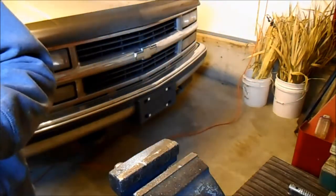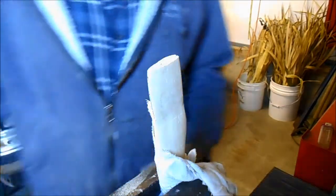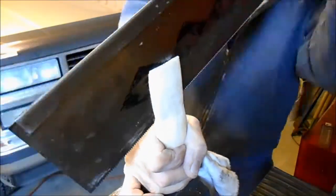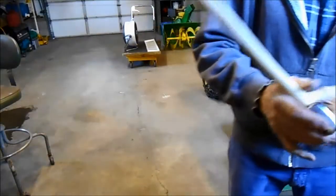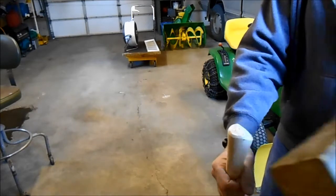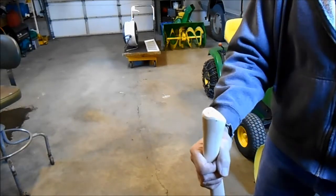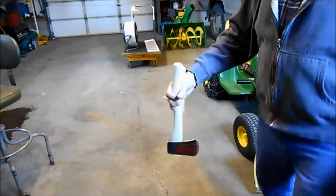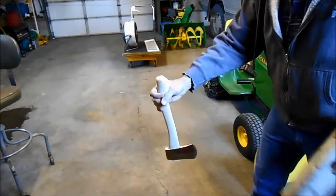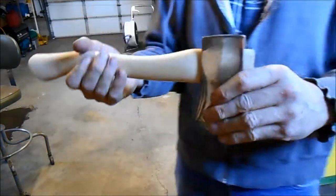I hope I didn't mark my handle up — nope. Almost there. Alright guys, I've got an ancient back saw here — I'll try that, it works way better. We're going to hang this axe. I'm going to hit it on the back of the handle, hanging it toward the floor, and I'm going to hit it with this 4x4. I don't have a dead blow hammer — can you believe that, with all the tools I've got? And then we will put the wedge in. Look at that! Now we're going to drive the wedge in.